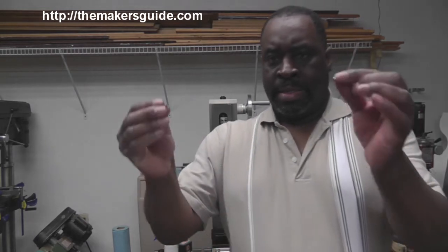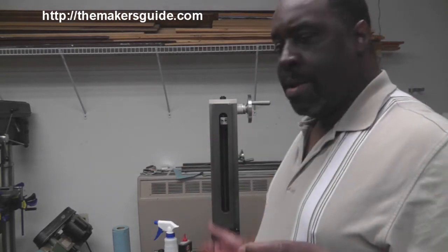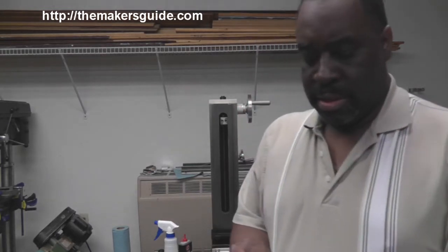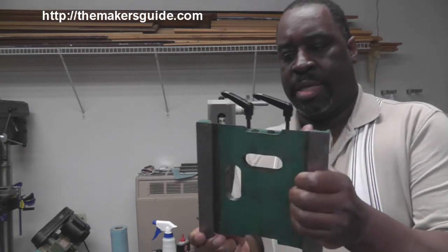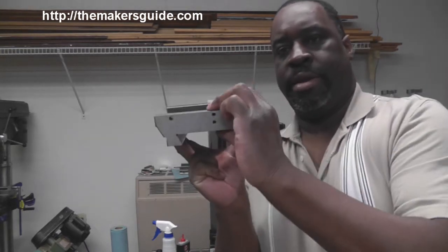These go between the levers that lock your carriage in place, and they push up against the gib. You don't want to lose these, so put those in a bag someplace where you can find them. I went back and checked — there are little pins in each one of these saddles, so you've got to gather them up. These ones on the back of the saddle did not have springs; the ones on the front of the saddle did.